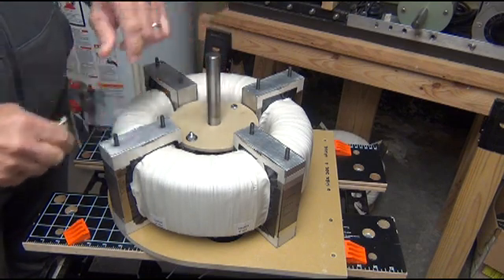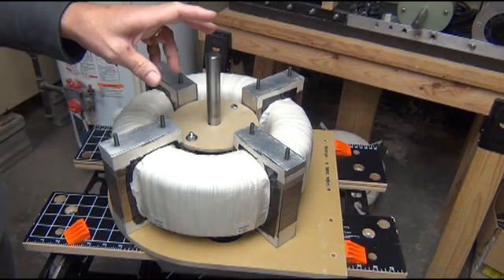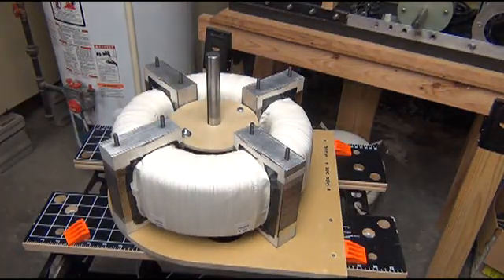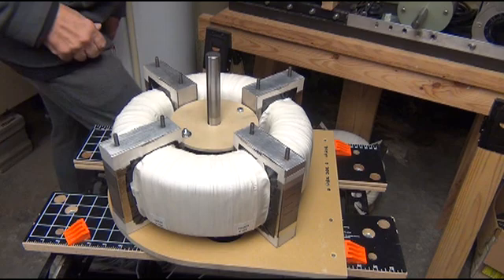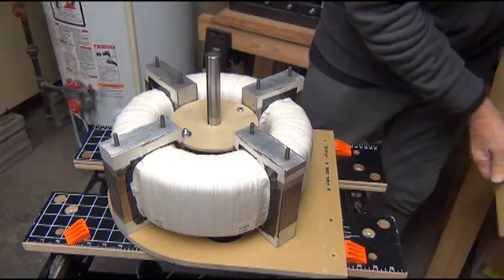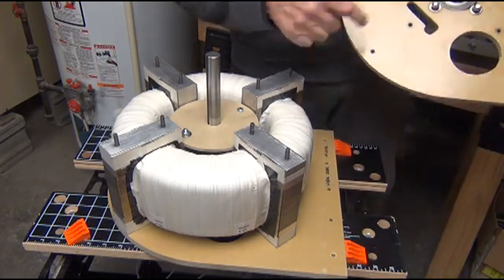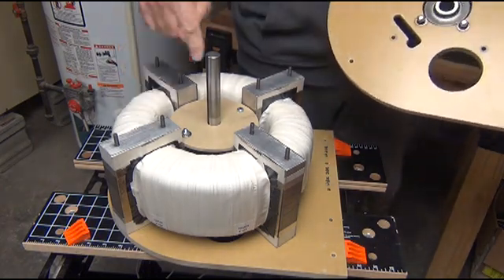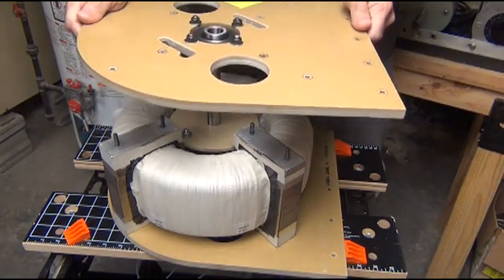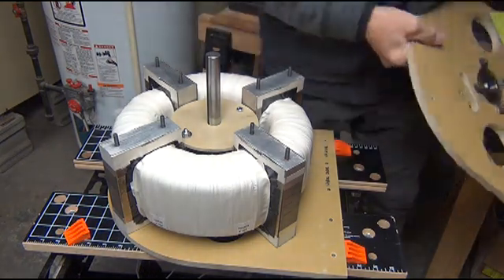It's just sitting in the bearing right now and the bearing bolts are loose. I'm going to show the shims going in here. The only thing we have to remember is the orientation. The slots are here so we're going to be doing these two with the shims — the grooves are in place so I can pull the shims out.